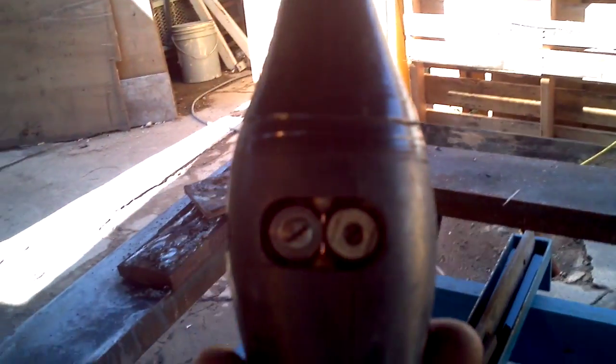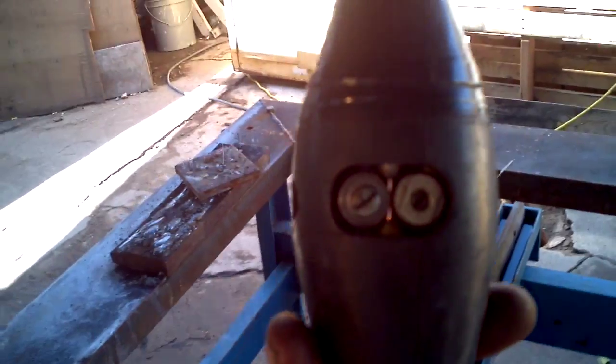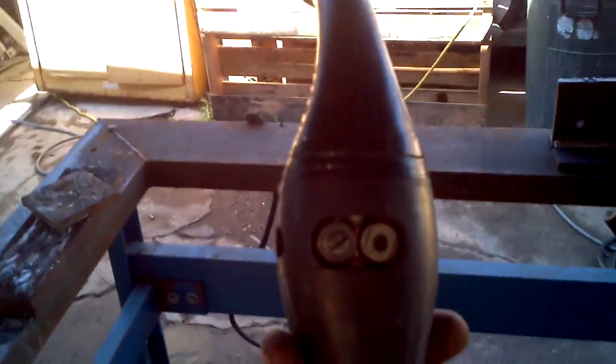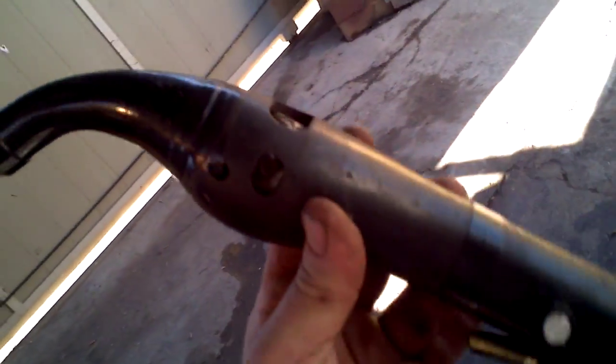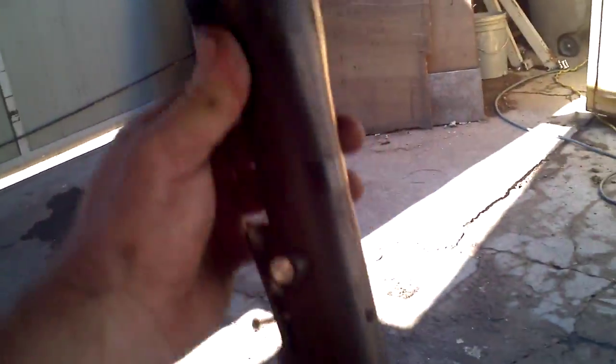It's a push-pull system. Push-pull system: it's got a high-speed but low-torque feed in the box, and that's the pushing. The pull here is adjustable by the potentiometer on the side of the gun. That's your standard push-pull system Cobra.